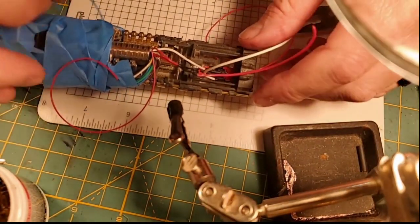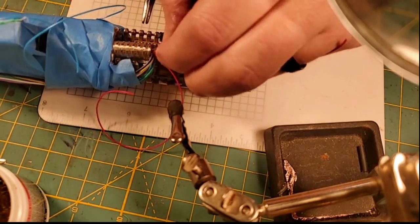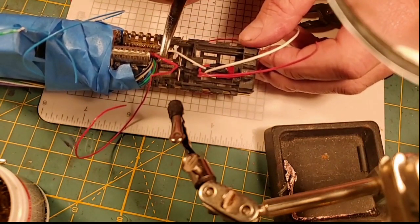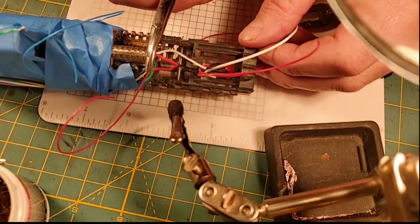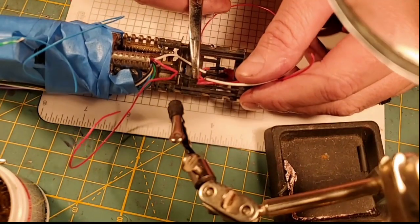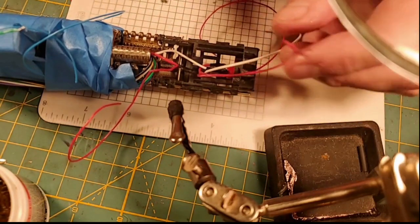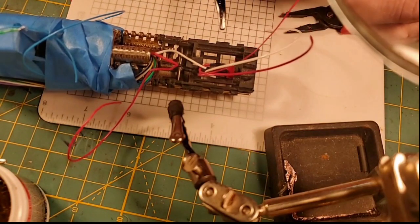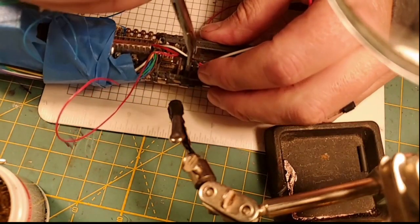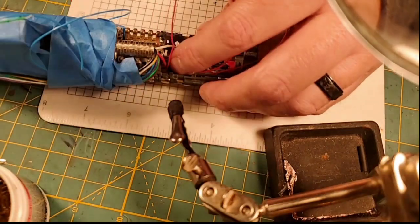So on our merge, the thick wire coming out of our wire channel, this is the battery positive and Neopixel positive. So this is connected directly to battery positive. This 30 gauge wire is going to feed our crystal chamber Neopixel. This wire on this side of the chassis is going down to our positive on the recharge port. This wire is a 26 gauge, which is going to feed our proffie. And this 30 gauge wire is going to feed our Neopixel accents that are going to do the spool feature in the back of the chassis. So I'm going to go ahead and put that merge down there where it's going to live.